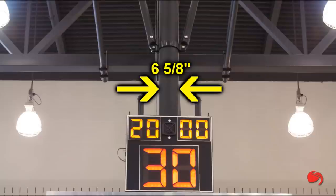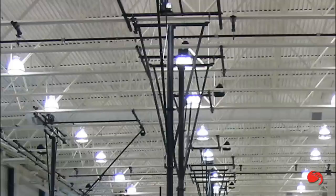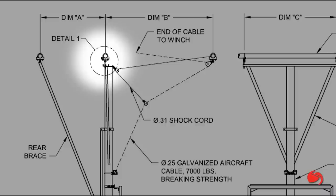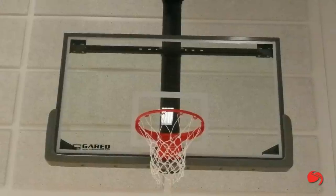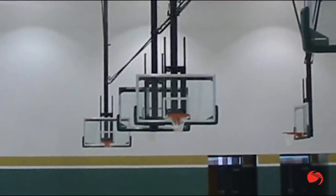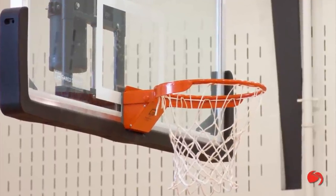With a 6 and 5-eighths inch outer diameter mast, the 3100 series is exceptionally rigid when faced with heavy play. Horizontal braces are precision die cut to allow full contact welds, and bracing is custom designed for maximum rigidity for your particular ceiling height. Forged eye bolt mast hangers allow for smooth operation and 6 inches of adjustment, ensuring precise leveling and alignment of the unit. These engineered systems feature welded construction when ceiling heights do not exceed 28 feet; clamped units are used in higher ceiling applications. The goal itself is mounted directly to the main mast so that forces are transferred through the backboard to the support structure, and this heavy goal mounting bracket is adjustable to ensure the exact plumbing of the backboard.